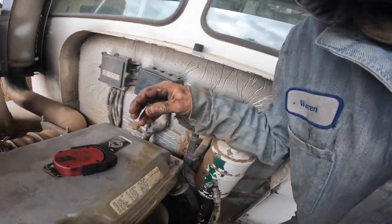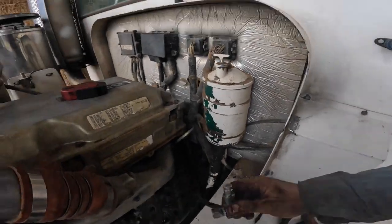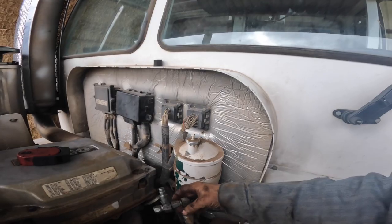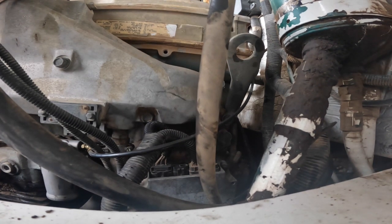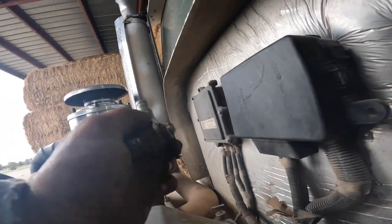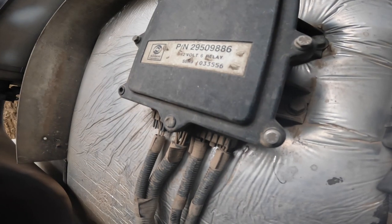Maybe I might be able to rig something up here. Hang on. These kind of tees right here are pretty handy. So what we can do, this has got a CompuCheck fitting that's teed into this female and male JIC connector. So what we can do is take this and screw it back onto the back of the head. Hopefully there's enough room to get a fitting on there. I don't know, it's gonna be tight. And then we can check our gear pump pressure.